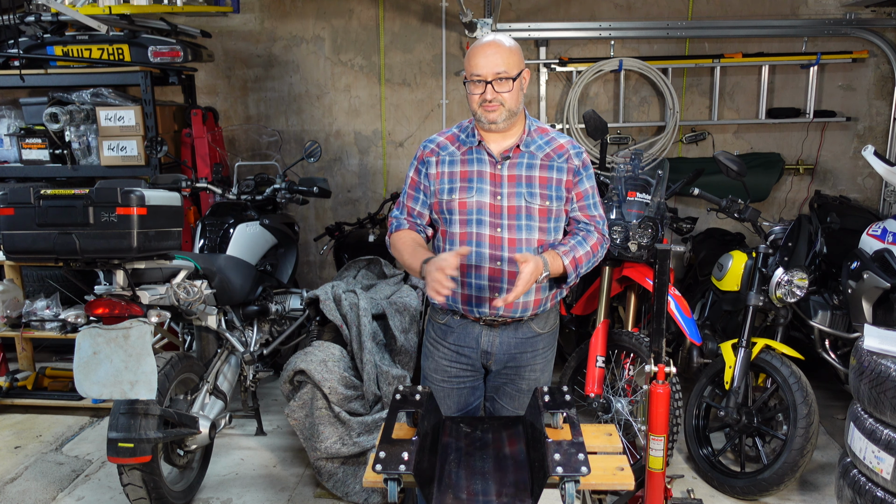But just while it's here, so what I'm actually doing, I did ask if I could return it, but actually it does seem really solid, and it's certainly the best example that I've found of something like this. So I would like to make it work rather than just send it back. So I'm going to take a rather rash move, and what I'm going to do is I'm just going to cut here with an angle grinder on one side to open this gap up, hopefully wide enough that I can fit the rear tyre into there, and then I'll be able to get the centre stand down. So my Wednesday short this week is to take an angle grinder to this brand new 6mm steel motorcycle dolly for a centre stand to see if I can make it fit an R1200 GS.